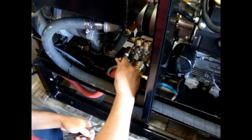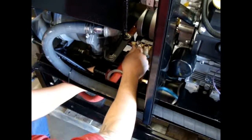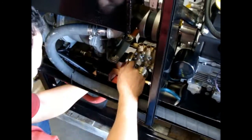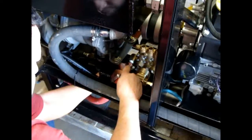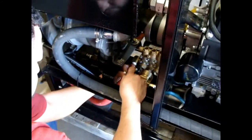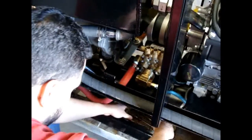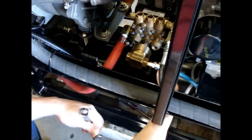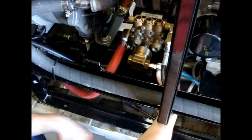Use 5/16th to take off the barb. Then take off the bushing. This one doesn't have the quarter inch 45-degree angle, but if you have the 45-degree angle, make sure that you hold that 45 to unscrew — the size is 11/16ths.